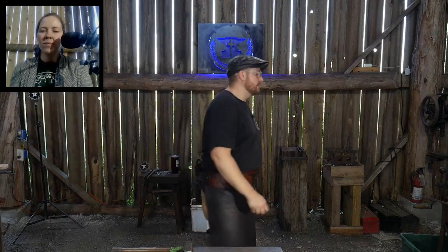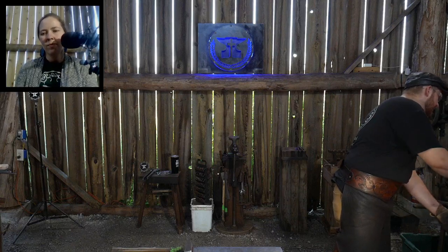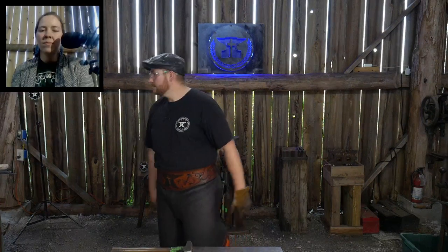It's a mechanically aspirated gas forge, so it's got forced air through it that mixes with the gas and ignites, very similar to a ribbon burner. It's not a ribbon burner forge, but I'm saying that so you understand the principle. So that's loud. That's great for production if you're going to put a bunch of pieces in and I can't give the pieces my utmost attention. I like using the gas forge for that.